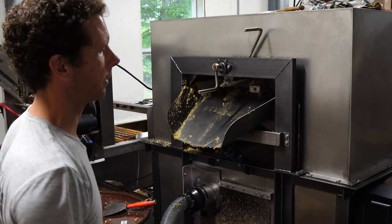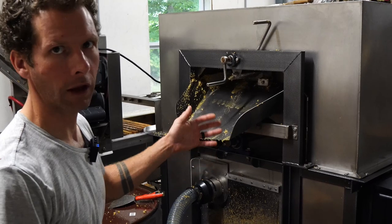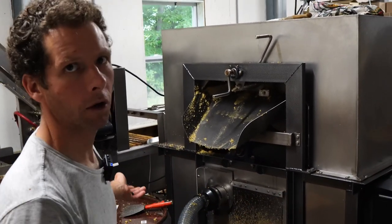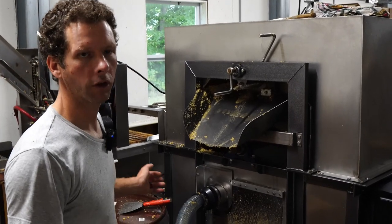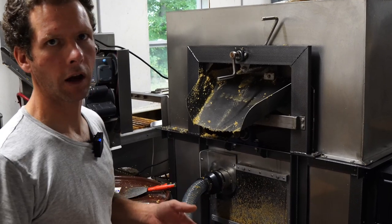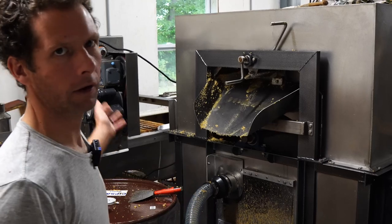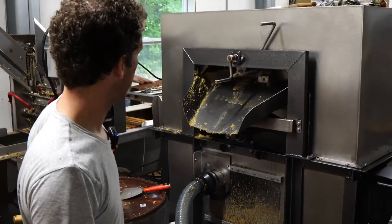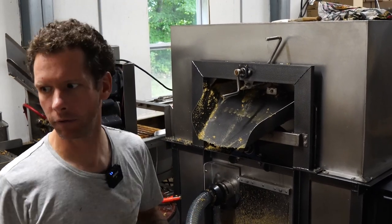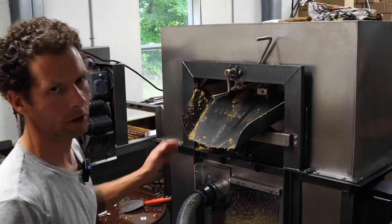There's the bigger variety or addition that you can see is out there for the larger systems. But the nice thing about this is it's sized very well with the auger. So every time the reservoir above the auger is filled with honey and all the cappings from the uncapper, you turn the auger on, pumps it up into the spinner, and it's pretty nice. If you really have supers that are full of honey, lots of cappings, pretty much this is running all the time.